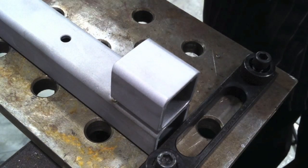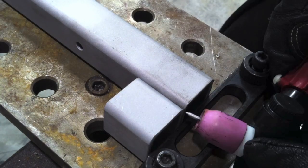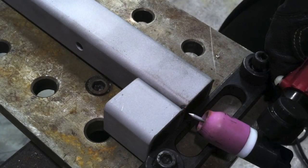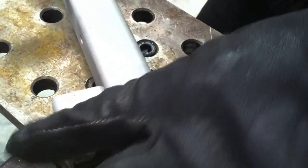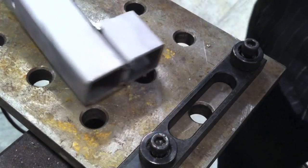You've got to be very quick and you've got to practice on some scraps so you don't blow holes. But this is a pretty good technique for materials that aren't crack sensitive, and mild steel is about one of the least crack sensitive metals you can weld.